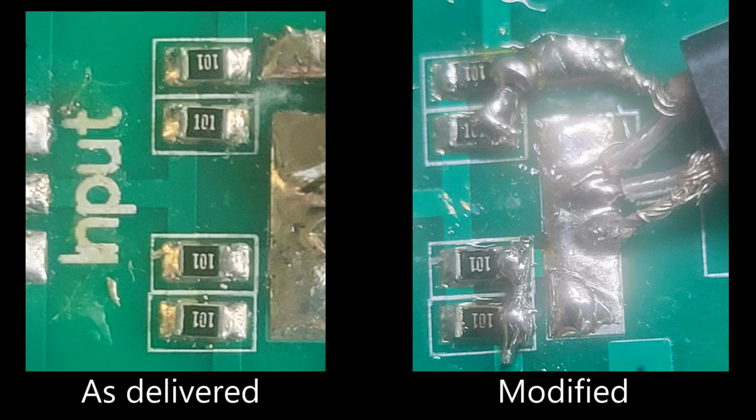There's a tiny little segment of wire I got in there and that was tinned and attached it to both of those. And then on the top pair, the upper two, there's another section of wire there that's at an angle, and with my fat fingers and big tipped soldering iron, best I could do was what you see. But effectively, I tied the output or the downstream side of both pairs of those together as they should be, and the bridge started working and did what it appears, to my novice eye, to have fixed it. And so now it does what it's supposed to.